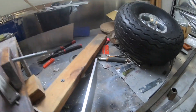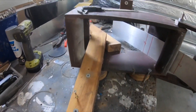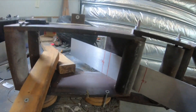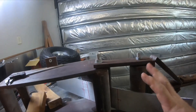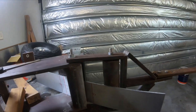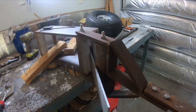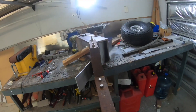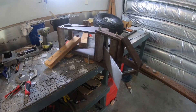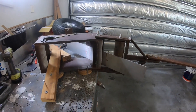What I'm going to do is clamp it with these clamps on the back side like that, so it won't move. Line it up where I want it, make sure it's completely square this way as well. And I just pull it around until it's at the angle I want, which is 90 degrees. It's pretty simple, but I just thought I'd show you guys what I've actually — this was made about two years ago now.